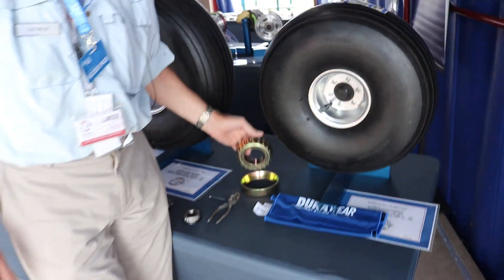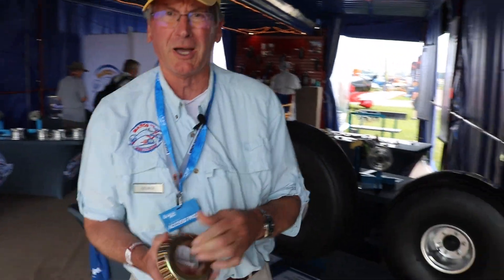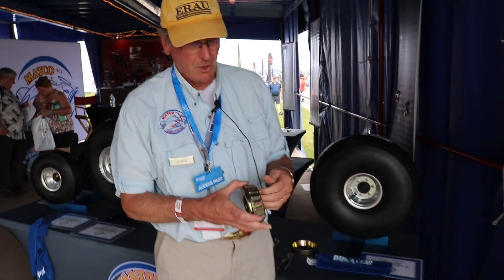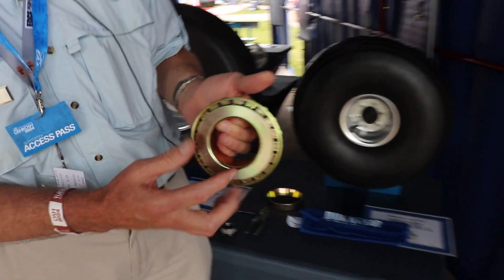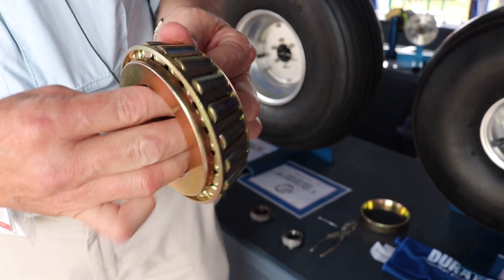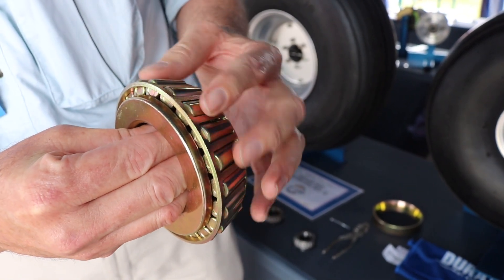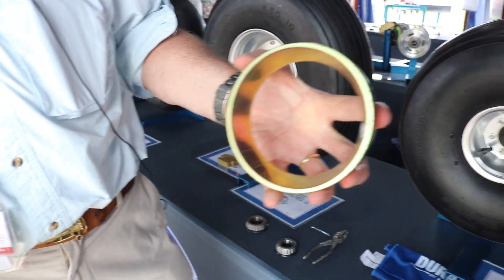So what is that doing? Here is a large-sized tapered roller bearing. That seal is fixed to the ID portion of the tapered roller bearing, and when it's rotating and you're seeing the steel going, the whole seal is actually rotating on the axle. You need enough preload on it so that this stops rotating and the rollers are doing the work.